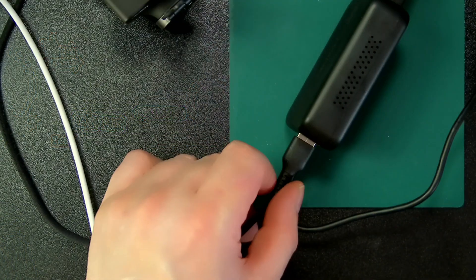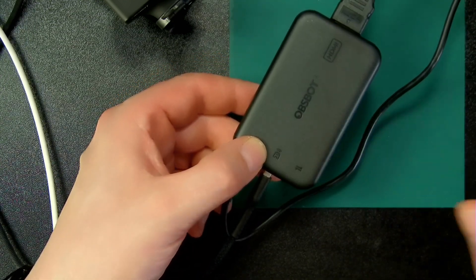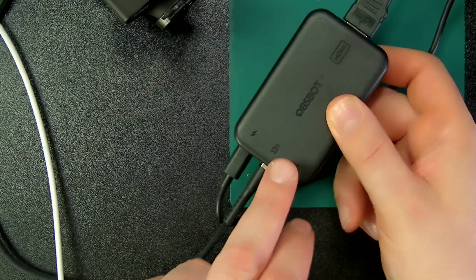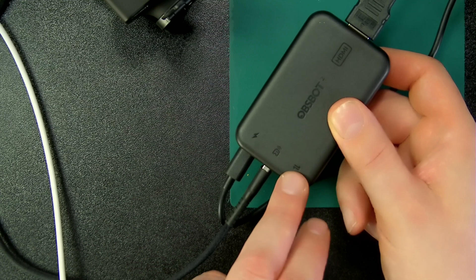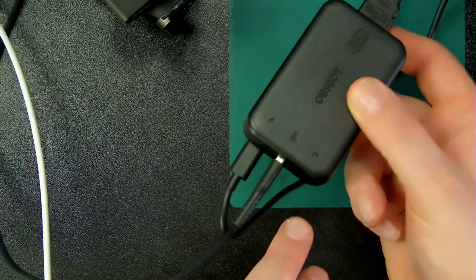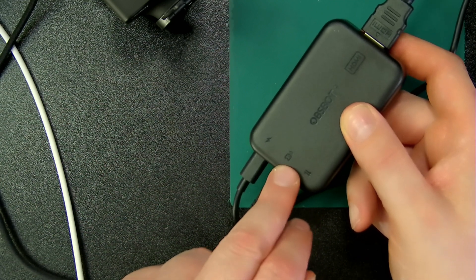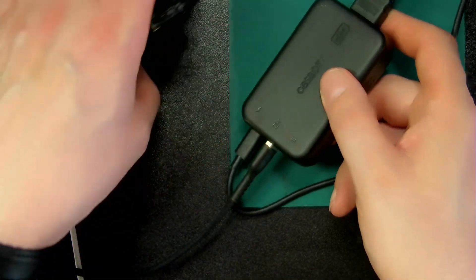This is the downward shot, and here is the box. I tried to hook it into the DJI Osmo Pocket 3 but couldn't get it to work. The input they say to use didn't work, but I found out that if I use the USB-A input and hook it into the back of the DJI Osmo Pocket 3, it will activate webcam mode and function. The other input is just for power.